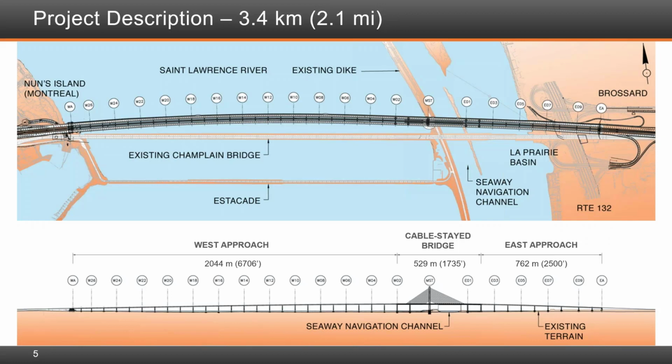Okay, thank you. What material was used between precast deck panels? High performance concrete, much similar to what was used for the high performance concrete in the panel. So the compatibility of material there. If the question is asking about the material itself between the precast panels, for example, of the segments of the MST or the pier caps, it was epoxy. If the question is about the stitch cast in place of the concrete, which shows a big gap, that was, like Guy mentioned, the same properties as the parent material in the precast panels. Yeah, the question was pertaining to the precast deck panels. So it's the same concrete material as the precast element.